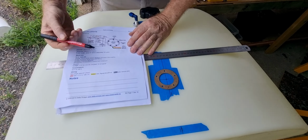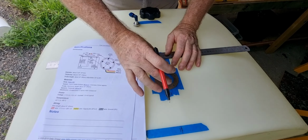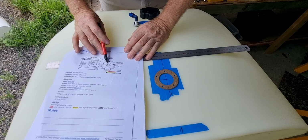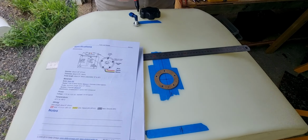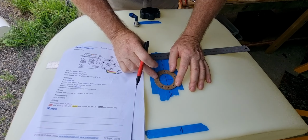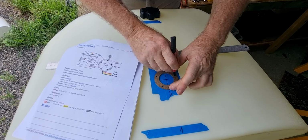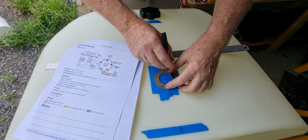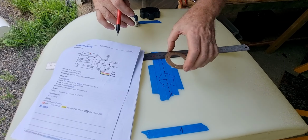Okay, I've just laid the washer down in this location, and it is noted on the drawing that it looked a bit funny. It looked like it was twisted to me, although I've got that hole and that lined up, and it does actually say on here that these angles, for whatever reason, are different. This angle here is 66 degrees, the other one is 72 degrees, and the only explanation I can give you for that is there are probably some components, and maybe there's only one way this can orientate, or there's something inside there that allows it to only go through that point. I don't know, so I'll just take it for orientation purposes only, and I'm going to commit to that. So I'll just mark these holes out. That looks like it.